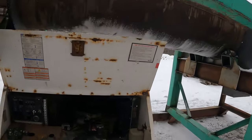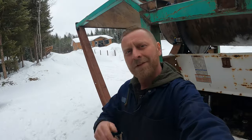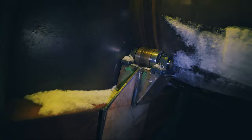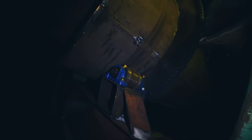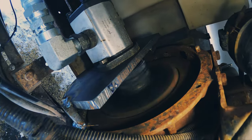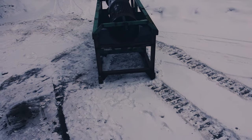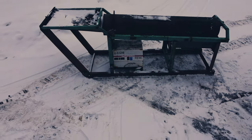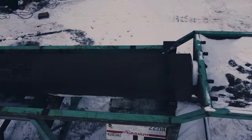With all the fabrication done, there's only one thing left to do. This is my fifth trommel I've built. The first trommel I ever built for myself made me go broke the first year. I've learned massive amounts of information on how to build these things ever since. Once out in the field, a person can fine-tune things — that includes spray bars, roller alignment, and even the size of the screens to catch the gold you're mining for. A wash plant is just one of many things that can go wrong on a mine site — money just doesn't fall out into the sluice box. To buy a trommel like this used, you're looking at around $30,000; brand new, around $60,000. This is not an MSI trommel, but it'll work just as well.